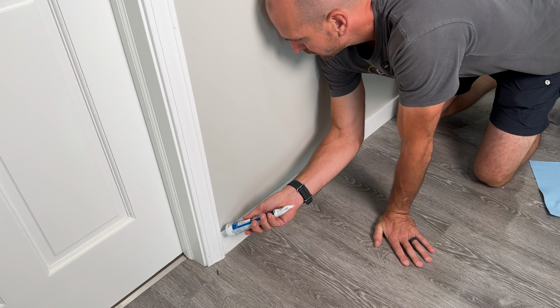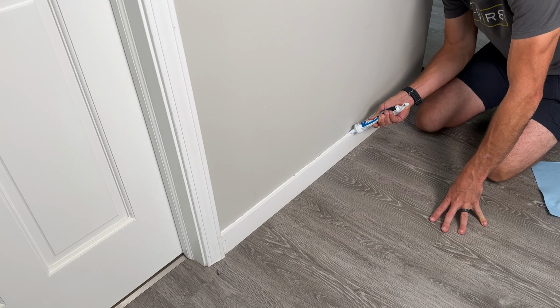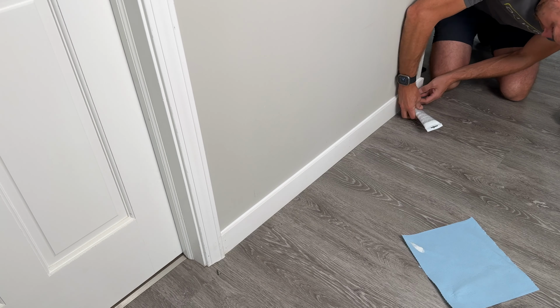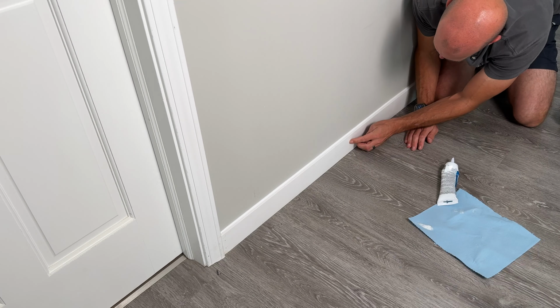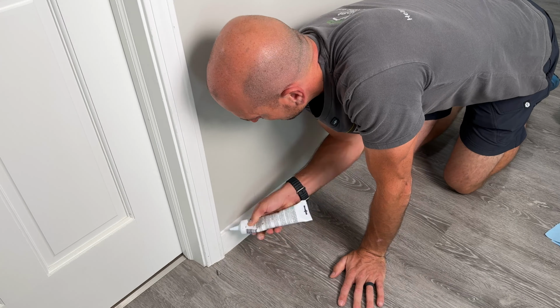And then last step, we want to go ahead and caulk any of those seams that we opened up. Here I'm just using a squeeze tube of Dynaflex 230 because it's a small repair job. Usually you'd use a 9-ounce tube and a caulking gun to make sure you can lay a consistent bead. And then go ahead and fill in those holes, smoothing them out for the screws and also the brad nails. But don't forget something like between your door trim here and the baseboard trim as well. So here's the finished product, and I think it looks as good as new without any drywall work or painting.